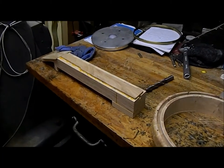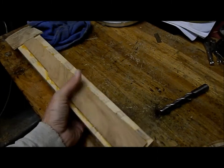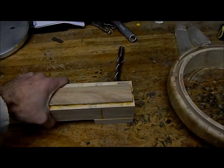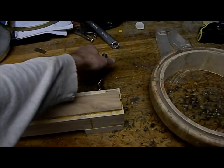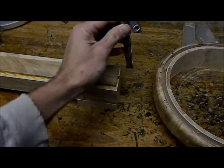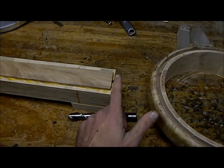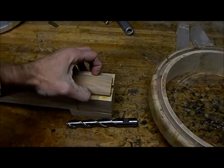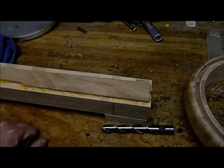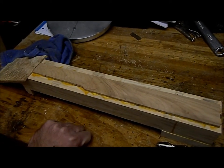Okay, we're back from the glue up, and we saved our ass. We've got a fretboard on here, and it's stuck good and proper. It's on there nice. So we're gonna take this thing, clamp it in the vise at a 3-degree angle. We're gonna take our friend here, the 3/4-inch cutter, and we're gonna kiss along these edges and cut the part out that's gonna seat against our pot here. At a 3-degree angle, I always draw my fretboards large, and I'll just kiss the edges of them, and that'll line it up. And plus I kinda like a wider fretboard by about an eighth. So this one's for me, or if somebody gives me a hell of an offer.